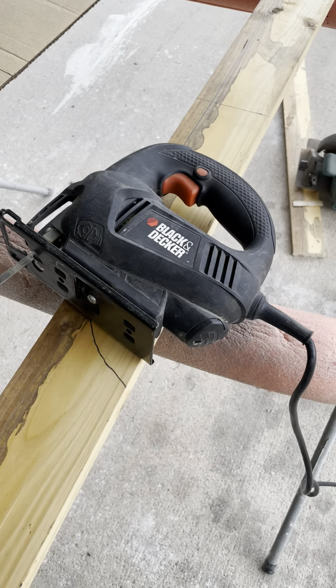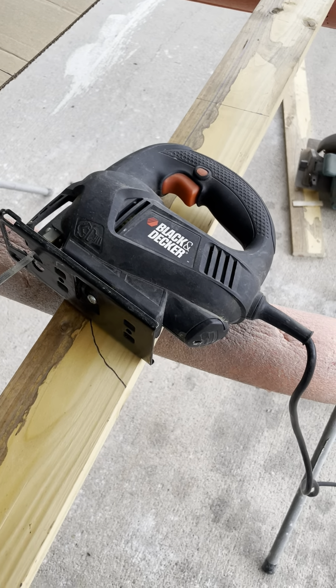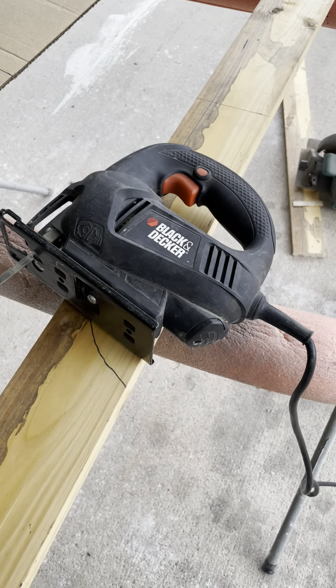So I got me a 1x4 out of the building, cut it down to where it fit, slid it underneath the edge of the tub as far as it'll go. What I'll do is mark my center line on that, then take it out, lay this on it, get it marked out, and cut it out with a jigsaw.